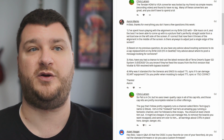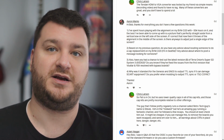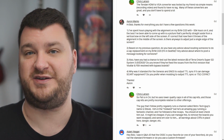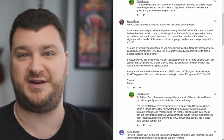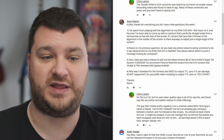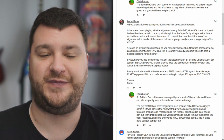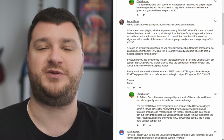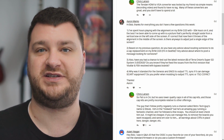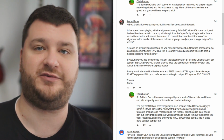Like, there were a few people I knew that took their own personal PAL SNESes, cut voltage, and put C-Sync to that pin. That's great, but what if somebody doesn't know any better and uses a C-Sync cable on a non-modded PAL SNES, then you're sending 12 volts to your device. So that's why. It's just a general safety thing, and even the people that disagree with me have to admit that all the consoles that we've seen have some kind of issue because of that, just because people forgot you need the custom cable, whatever else.